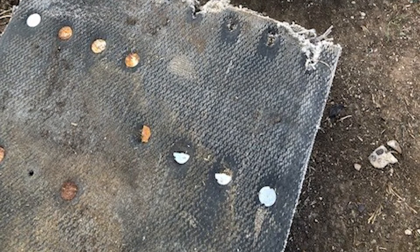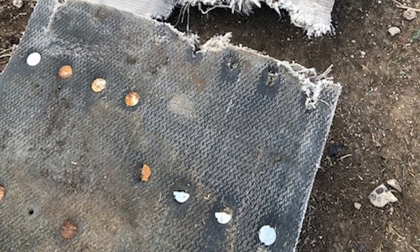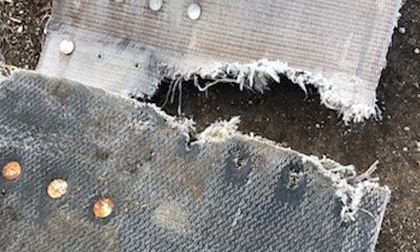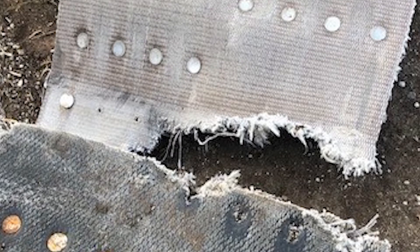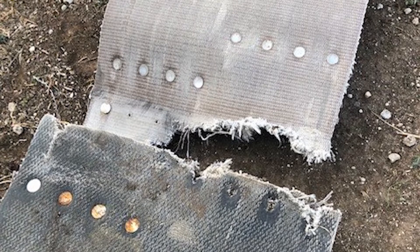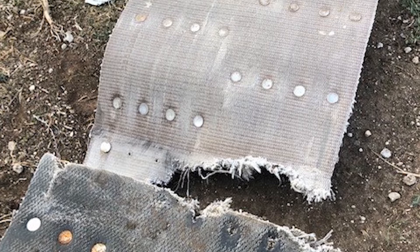Now the rest of the old belt didn't have any of that situation, but the splice had problems with maintenance and some bolts had come loose. What I told them is that most likely what happened is the buckets right there, closest to where the splice came together, had gotten loose. They got caught on something, or just the fact of digging through the boot had caused so much strain on that old belt that it finally tore away.